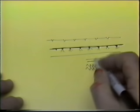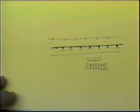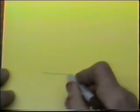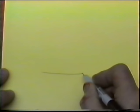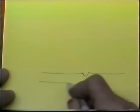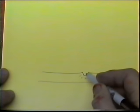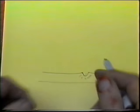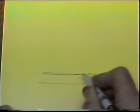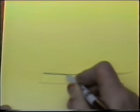So what we're looking for before we put any primer on our fillets is a tooth area. Just pretend something. We don't even have to pretend. We probably will eventually have to do this. Here you go. Whoop, you have a little bit of an imperfection in that aeropoxy light in the fillet. Well, you put your fingernail in it, or you didn't trowel it out right. You've got this little crater. Well, you want to fill this in. If it's real small, you can just fill it in with the Brodak primer, and it'll be no problem at all. But in some cases, it's just a little bit too much.